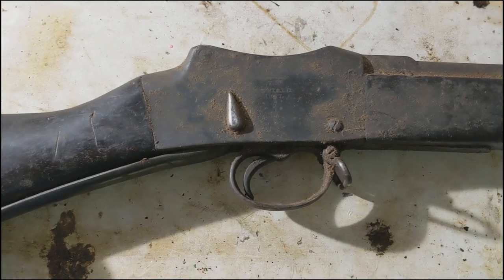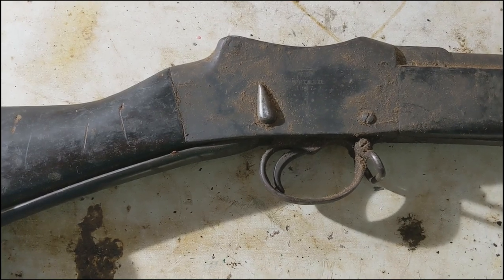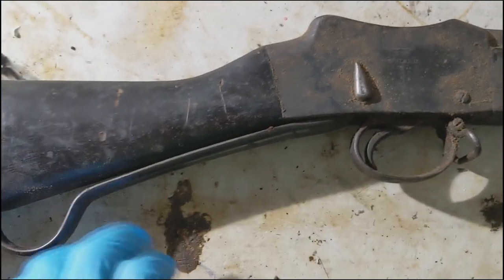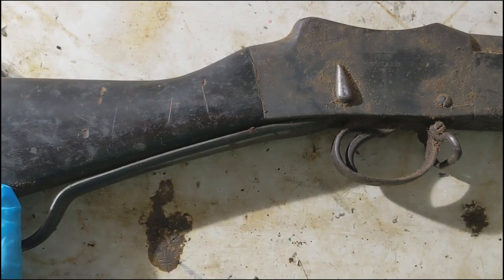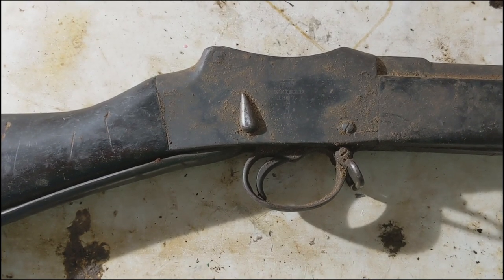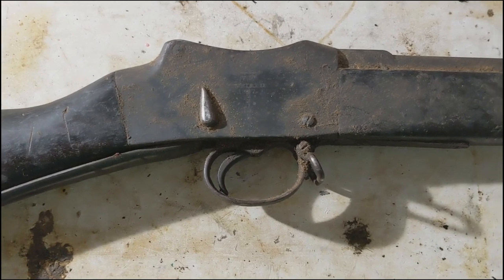As far as the wood goes, I like using some linseed oil. Just let it sit for a little bit and then you rub it with the palm of your hand with the grain of the wood. That actually will get a lot of this gunk out of it and then just wipe it down. You want to be really careful with linseed oil as it might catch fire. Make sure that you don't have your used rags laying around.